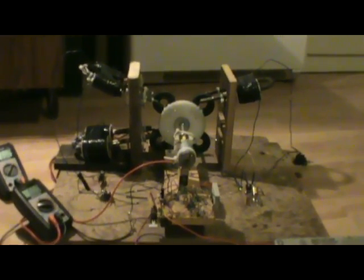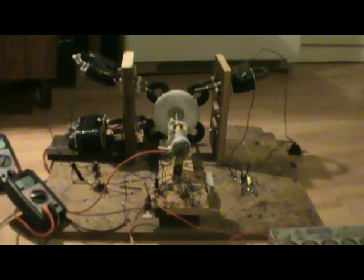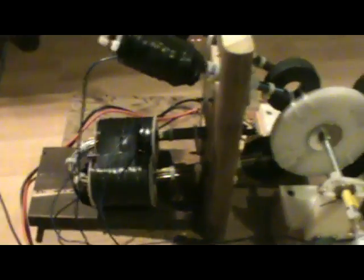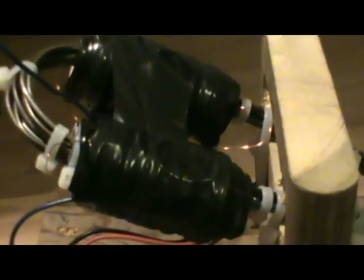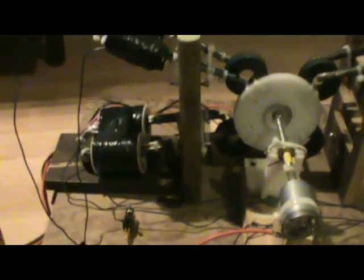I'll get into the specifics of how it works, but basically I have the Ed Leedskalnin type PMH setup, right, with two coils on each prong. The wire I used isn't ultra thin. It's from the microwave oven secondary, but it's about a 25 gauge is what I could figure from looking at it. Anyways, they're all the same. It's not the smallest wire. It's got a little bit of backbone, about 25 gauge.